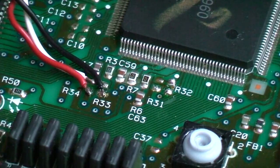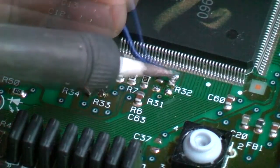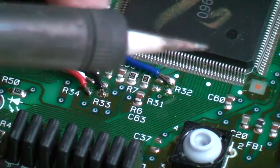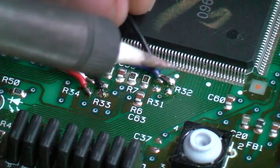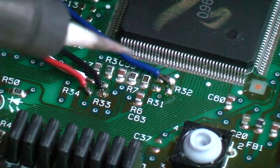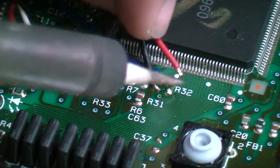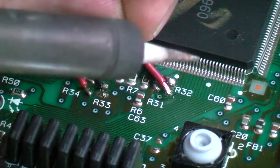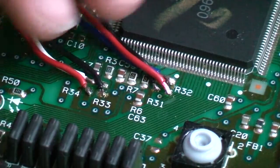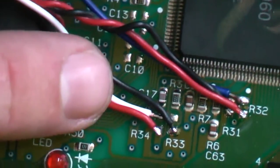That is all you need to do to enable your 50 and 60 hertz switching. Now for our language one, we're going to use the switch with the blue wire, and again, the top two connectors are actually joined together, so it doesn't matter which one you go to — just pick one that's convenient. You could even join the top two together with your wire, it really doesn't matter. All we've got to do is add our five volts and ground. This time the five volts is over near R32, and our ground is closer to R31 as a point of reference. We'll attach the ground first. These points are quite close together, so don't be afraid to go back and double check you haven't shorted anything out. You'd probably also want to add a bit of hot glue over the top just to make sure everything's nice and safe and secure.